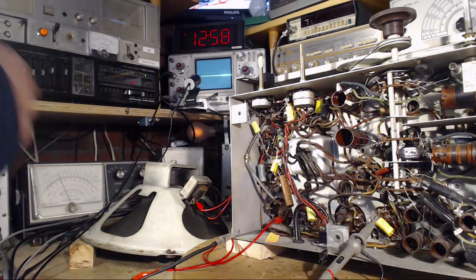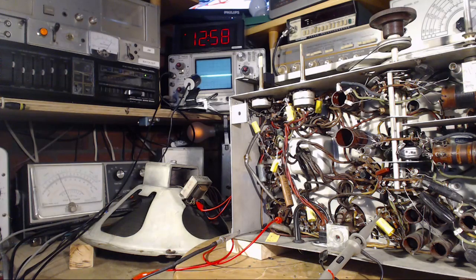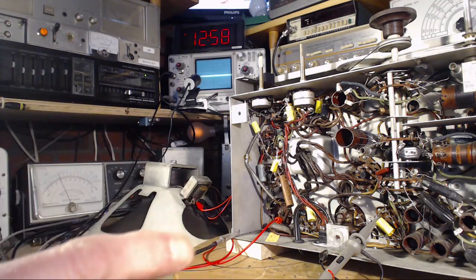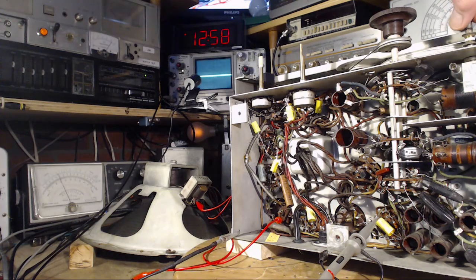So what we'll do is we'll take a note of what this voltage is. And we'll change that capacitor, and then we'll take a note of what the voltage is again, and make sure everything is tuned just right. Let's just make sure of that again. Very highest voltage on that meter over there. Now the capacitor itself makes this tricky. Look, I'm getting a little more there. Okay, that's the max.